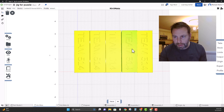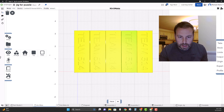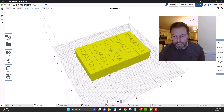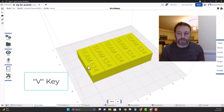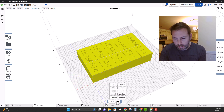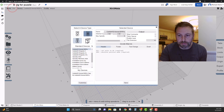The amount it may look off is more than it really is. Once that looks good, click off and rotate it. Hit V on the keyboard — that sets the focus of the screen onto the parts, and you need to hit V. Then go to CNC Machine and select the Carbide 3D Nomad, which is the one we're using.